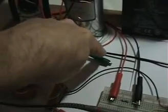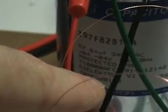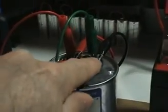The next thing I'll do is connect these alligator clips to the wires. The white one goes through a single diode to give us a positive charge on the capacitor, and the negative is directly connected. We're using a single diode and a 57.6 microfarad capacitor. The meter will measure the voltage, and we have a 1K ohm resistor as the load.